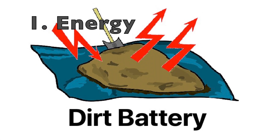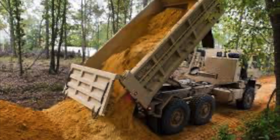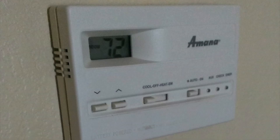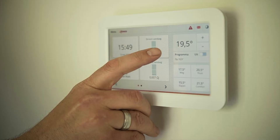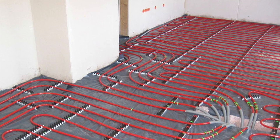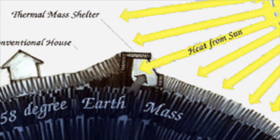I've explored the idea of a thermal dirt battery in a previous video using solar thermal collectors and a thermal battery in the ground made from clay. Earthships incorporate the thermal battery idea into the home itself on the back wall. This presents a problem with heat control especially in climates with cold winters. On any regular home, if you have the thermal battery outside the house, you can regulate what heat you want to bring in via a thermostat and have heat distributed via radiant floors, baseboards, or a furnace with ducted vents. This means much more stable temperatures. An earthship just uses radiant heat directly from the thermal battery at the back of the house, not allowing for much comfort control of the temperature.